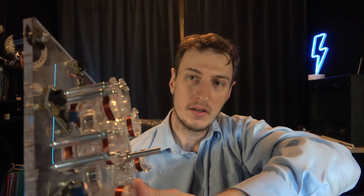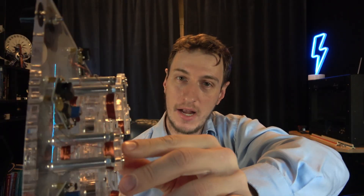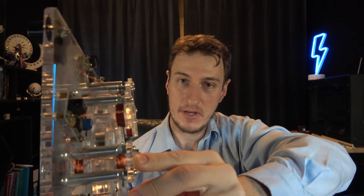Another way to look at this is just to look at an actual axial flux machine. As you can see with this, the actual copper windings are kind of thick — about a half inch thick on this particular demo unit. And what the PCB motor is doing is shrinking those coils down into the plate, so it's pretty much a two-dimensional design.